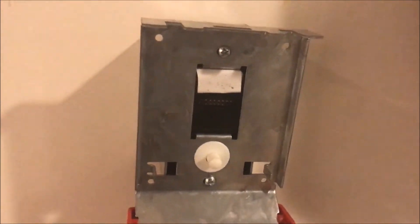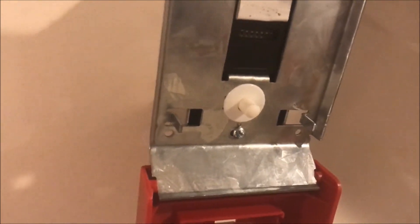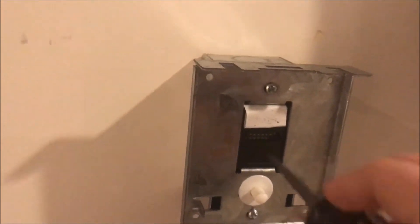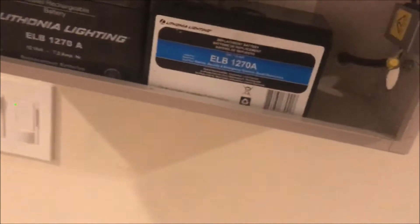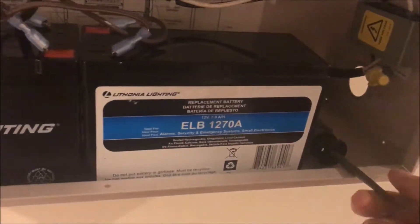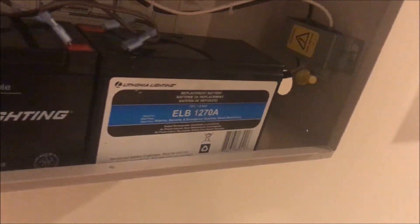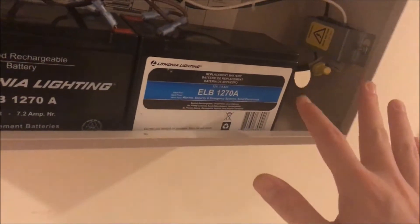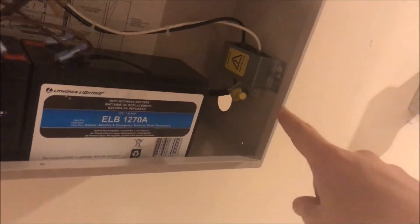I'm going to be setting this device now from point 1 to point 129. I have switch one up, and we're going to push switch eight up because switch eight is number 128, so 128 plus 1 equals 129. We're going to close that up. I know it has the M11 label on it but I probably shouldn't put that there since that's 120 volts right there. Word of the wise: don't store things in this corner of a Simplex panel — all your power comes in there, that's 120 unregulated volts.